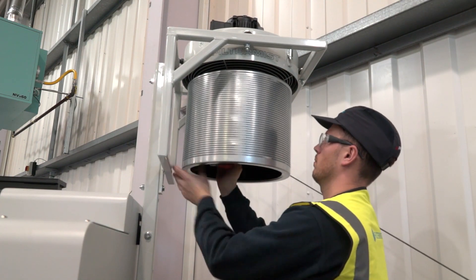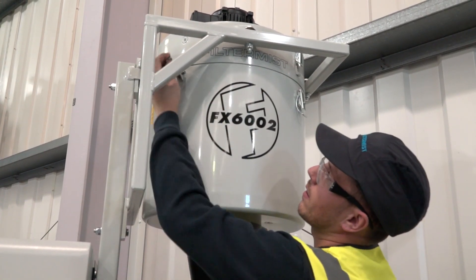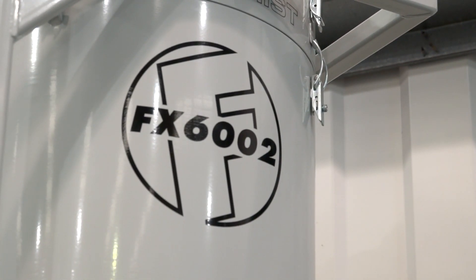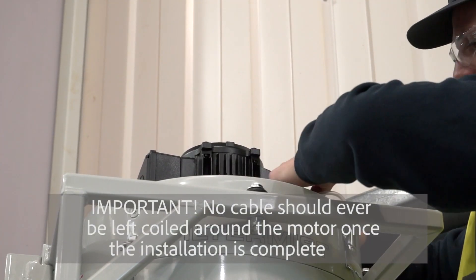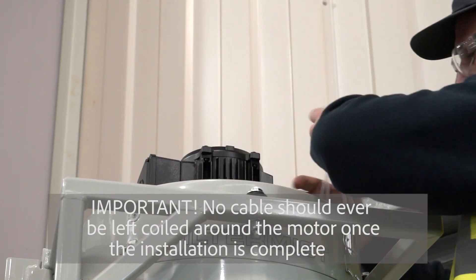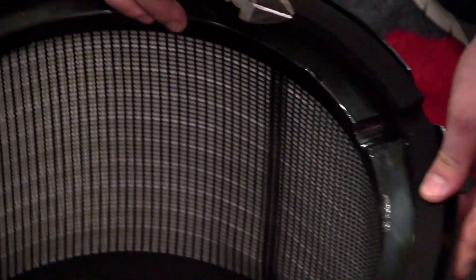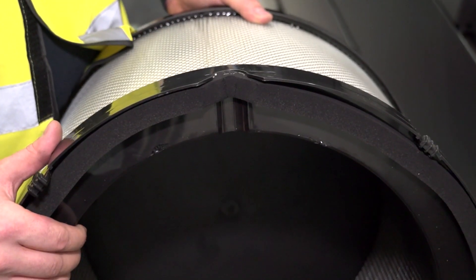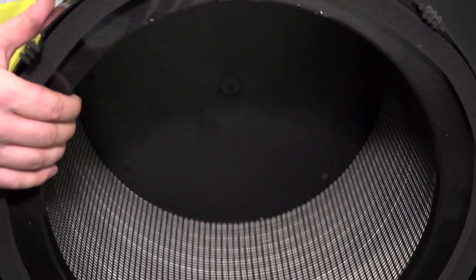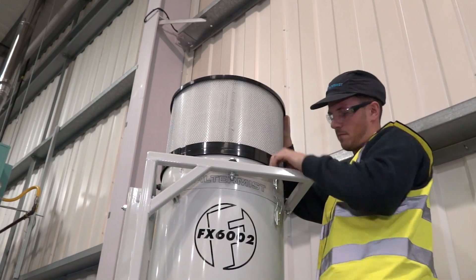Attach the drum, position the lower half of the casing, and secure with clips and safety bolts. Uncoil the F-monitor cable and the motor cable. If an after-filter is being fitted, snip out a small section of the foam seal in front of the cable recess groove to allow the trunking to pass through, then position the after-filter over the unit and clip into place.